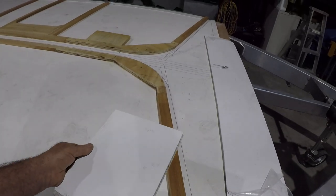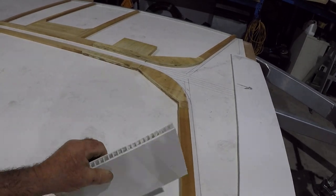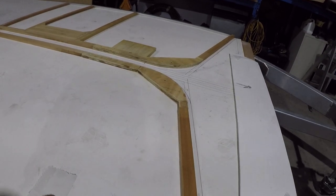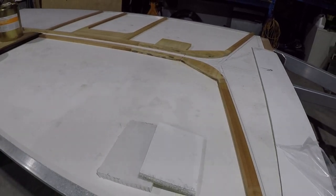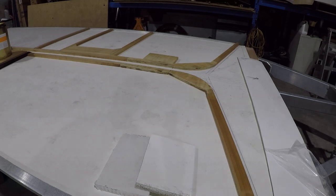I've made up a sample piece during the week with the fiberglass, just with some 10mm thick honeycomb, and I've given it a really good test. I've bashed it with a hammer and I've drilled and screwed into some other pieces, and it's going to work very nicely.